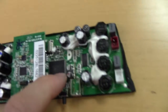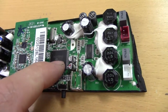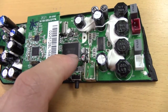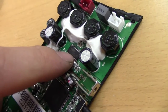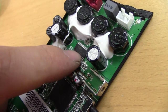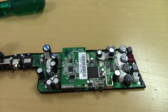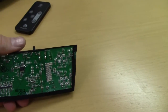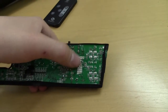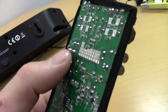This thing seems to be built around something I've never heard of before, DT Audio. You know, that's a Dolby decoding thingy. And then there seems to be some tiny little Class D amplifier there, an L1227 HABG. Probably some pretty standard 10-ish watts per channel thing. Seems to be fairly efficient there. I mean, getting away with that tiny package, it's obviously just heat sunk to the board there.